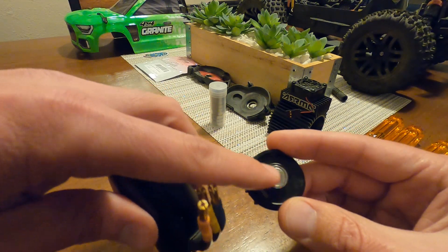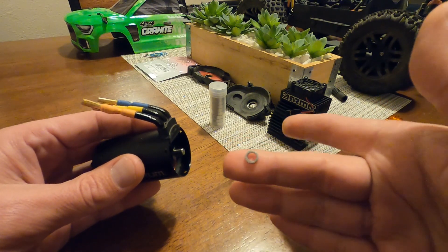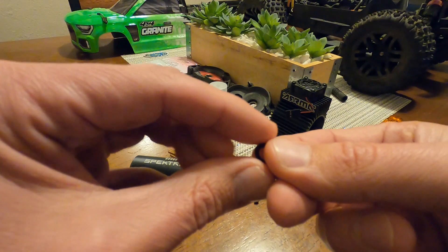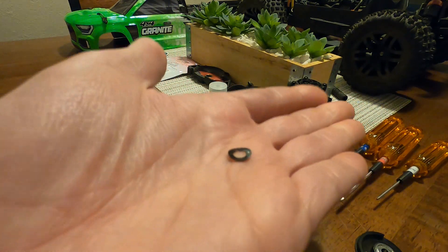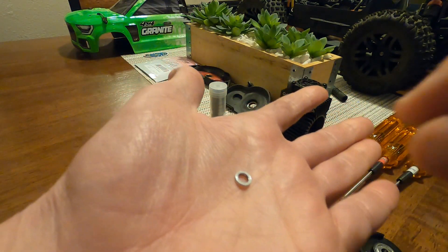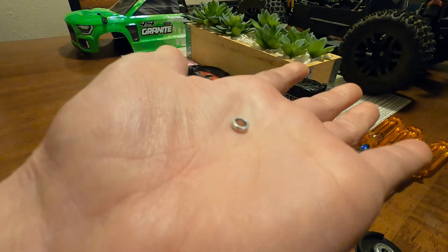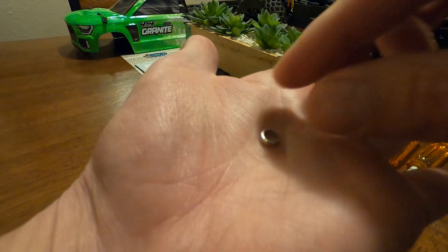This bearing on mine is perfectly fine — it was clean with no issues. Be careful because there is a spacer washer-type piece, and also another bent washer inside. This piece looks like trash and you might accidentally throw it away, but this curved bent washer is supposed to be like that — it's not damaged. Then there's this spacer, and it's difficult to tell, but one edge is beveled: one side is flat and the other has a slightly beveled edge around it.